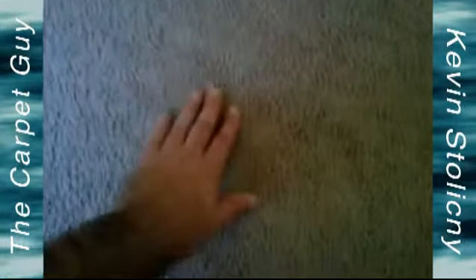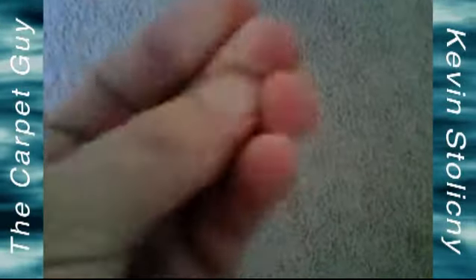There's the line. There is no dirt in that carpet. This is just a regular old Blackberry — I don't have any kind of fancy cheater software or anything. We're just using our normal stuff. We pretty much guarantee — we've made carpet last anywhere from two years longer up to ten. There you go, folks. There's an example. The like-new process: detergent first, a wiping process second, an extraction process third. We've got nice, soft fibers — these fibers aren't very fluffy because this is polyester and it doesn't really fluff very much. But there's no sticky residue on there. You can see my fingers are just sliding back and forth.